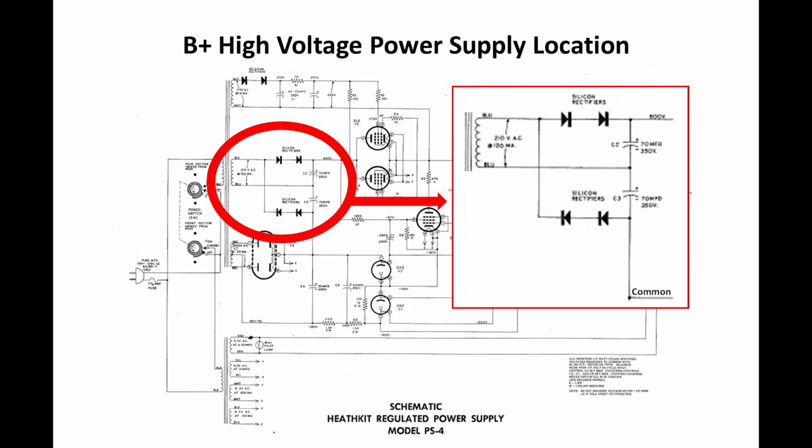Same thing with the diodes, because they're so old. They're really cool. They're ceramic diodes, much larger than diodes today. And I was a little nervous that they might have been getting close to the end of their service life, particularly because they're hooked up to a transformer that you can't replace today. You can't buy a replacement.